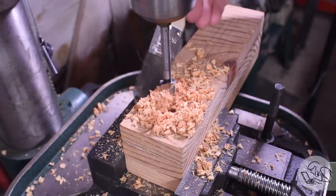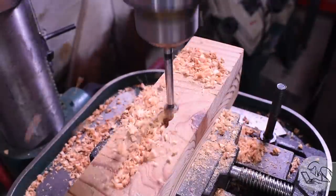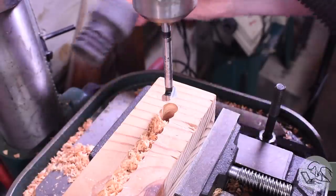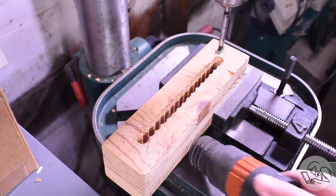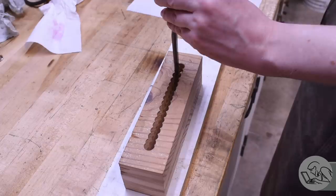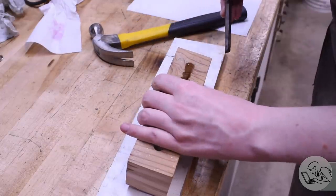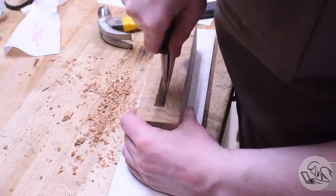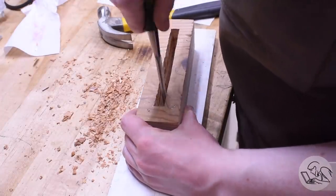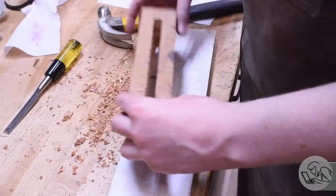It's going to be a drain basically. Eventually this engine is going to get built into a steam plant and the steam plant is going to have a sump that runs underneath the whole thing. Everything that can drip oil or water is going to go into that sump. So this is like a drainage trench that runs down the entire length of the engine and will someday feed into the sump under the steam plant. I drilled that out with the Forstner bit and then squared it up reasonably well with the chisel. This won't be visible, so it doesn't have to look great.